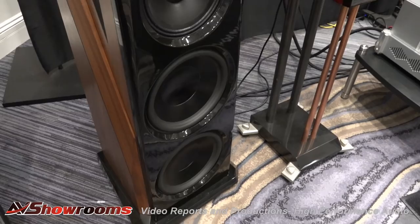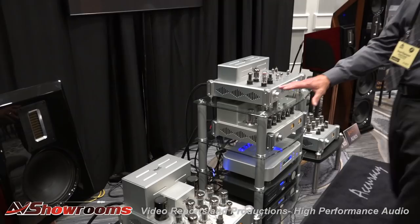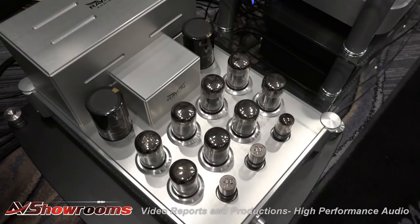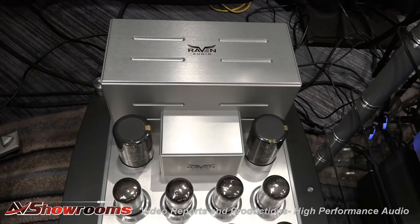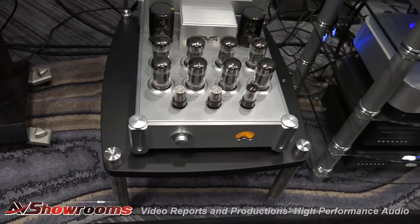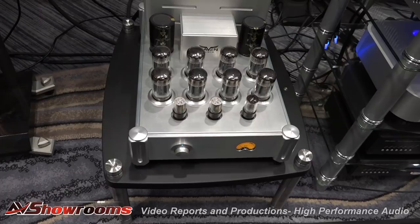And Dave, how about the amplifiers? Well, the largest one here is our flagship monoblock, 325 watts per channel. It's called the Shaman Mark II. It uses an octet of 6550 or KT88, KT100, KT120, KT150, all that line of power tubes. And we always put old 40s and 50s NOS signal tubes in the driver stage and the cathode stage, and it's fully auto-biased. Beautiful looking. You see these big caps here. Yeah, I do. Just big, gorgeous. As big as a Coke can.